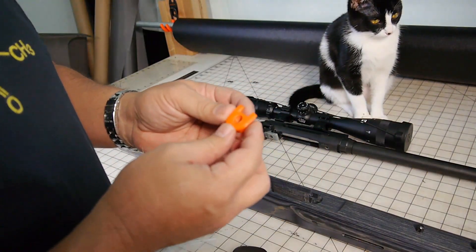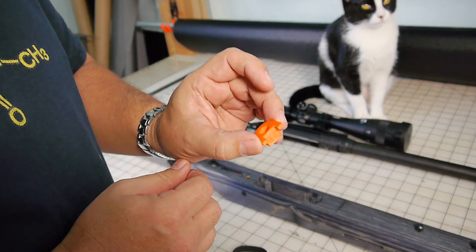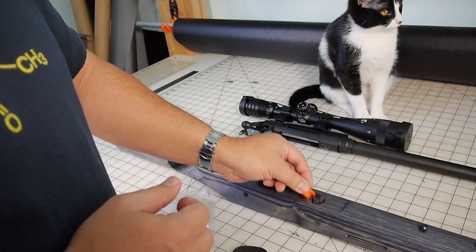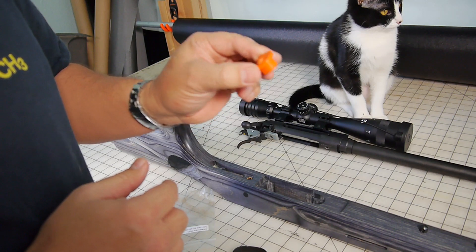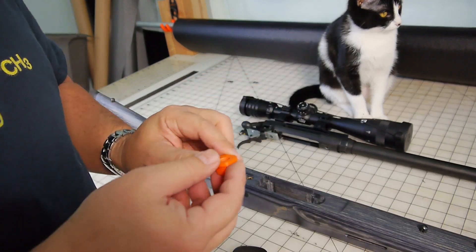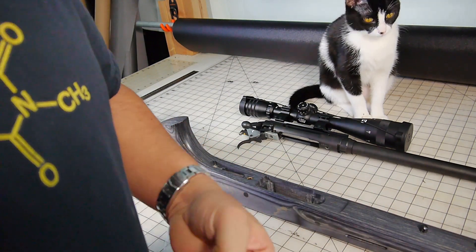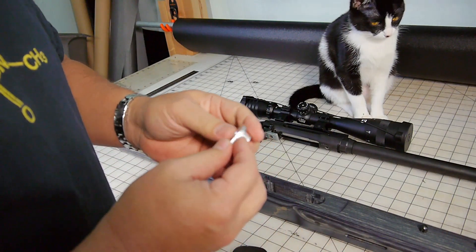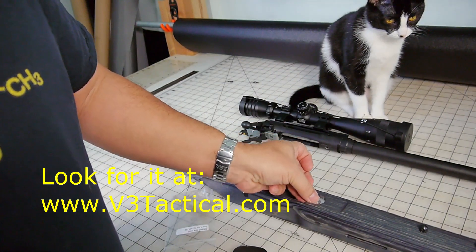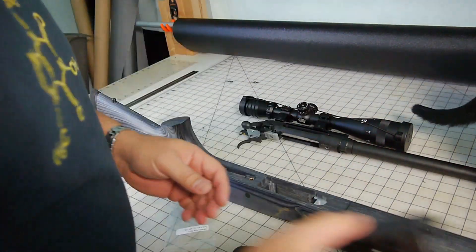So I decided to get rid of the last piece of plastic. First, I got on my 3D printer, measured everything out, printed it to make sure everything was in spec and my calculations were okay. It actually seated pretty well and was holding up better than the original piece. But that was just a test — I wanted to get rid of the plastic, so I got on the mill and made the piece out of aluminum.